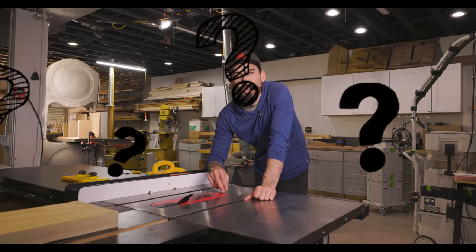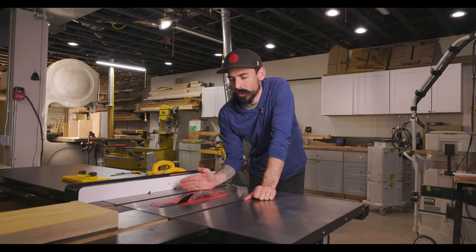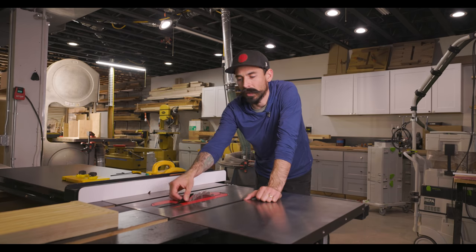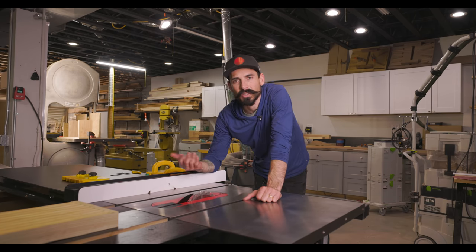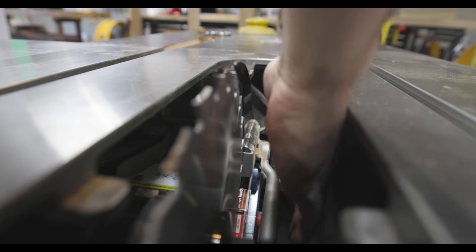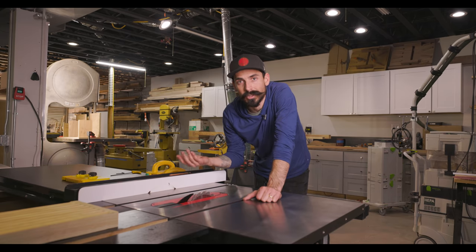So why would anyone want to remove such a key safety feature? One reason is excessive friction. More often than not, when wood tries to collapse in on the blade, it's not enough to cause kickback, but it's enough to grab the riving knife and cause friction as you push. In small shops or small projects, it's not a big deal — just push through it. But in a high-production shop making furniture or cabinetry all day, pushing several hundred board feet through every day, that gets really taxing on your body. Most shops end up removing it — I'm not saying they should, but they do.